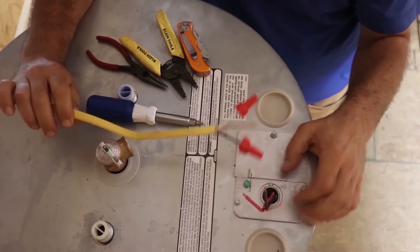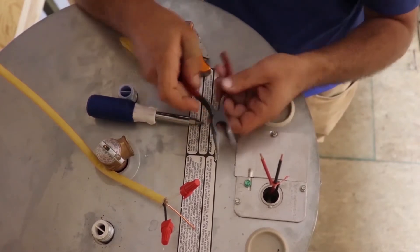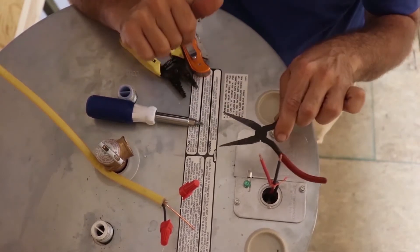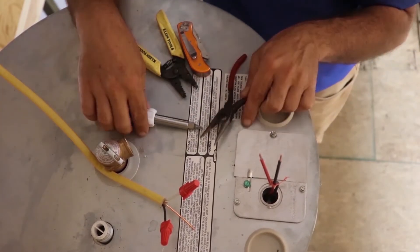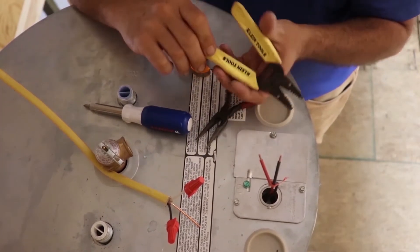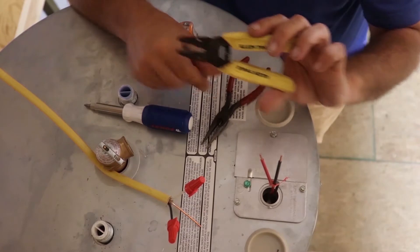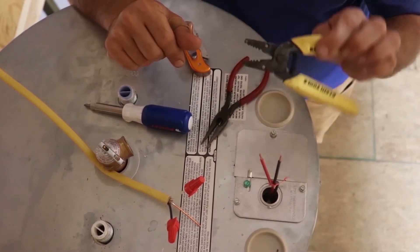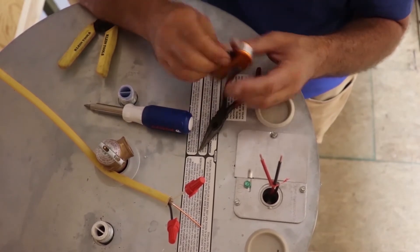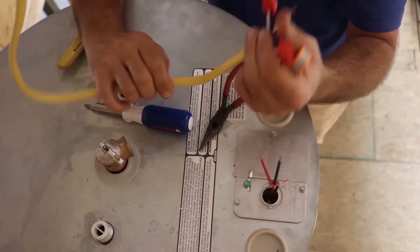But most of the time it is going to be your responsibility. You're going to need some tools. I've got an assortment of stuff here. Normally I just use my little needle nose pliers with the wire cutter in it, and that seems to do pretty much everything I need. Then you're going to want a screwdriver. But if you want to get fancy, you can get some of these wire strippers — if you're doing it a lot, a dedicated wire stripping tool is designed for it. You might also need a razor knife because you may have to cut back the housing.